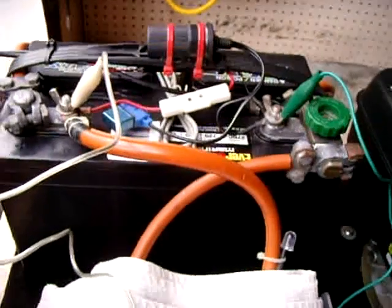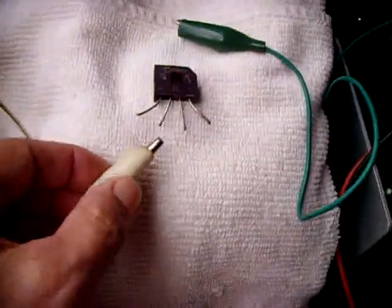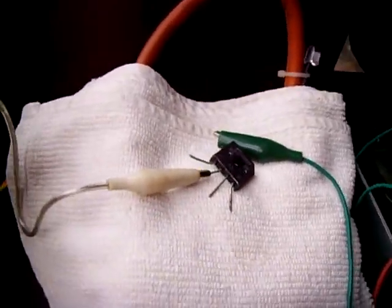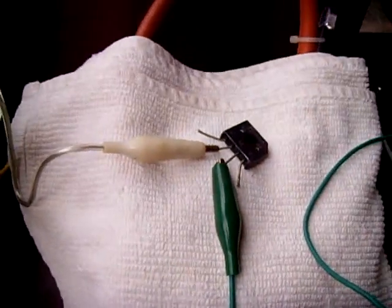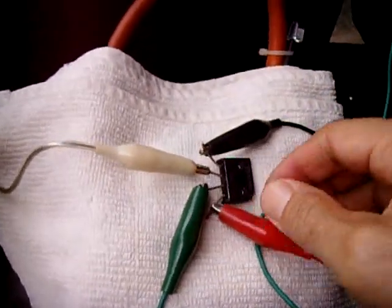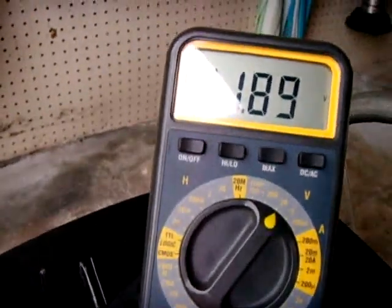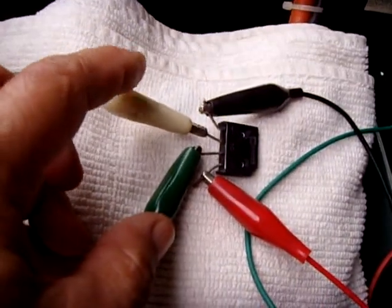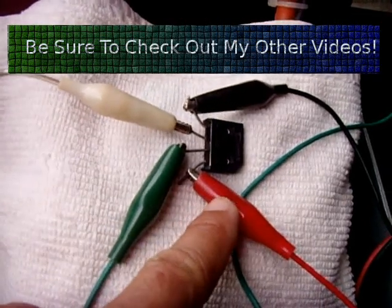You can take a 12-volt lead-acid battery or any other battery, take the negative and the positive, and connect it to either of the AC inputs. Once that's done, connect up the digital multimeter and you can see the voltage is 11.89. That voltage is lower because you're losing voltage going through the diodes. What this does is ensure that no matter how your battery is connected to a circuit, you will always get the positive where you need it.